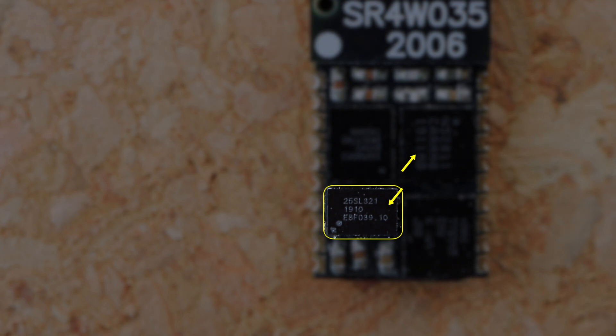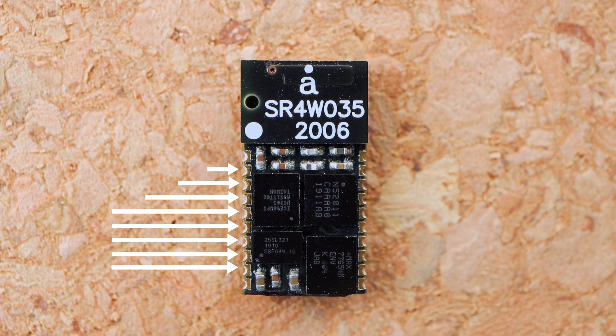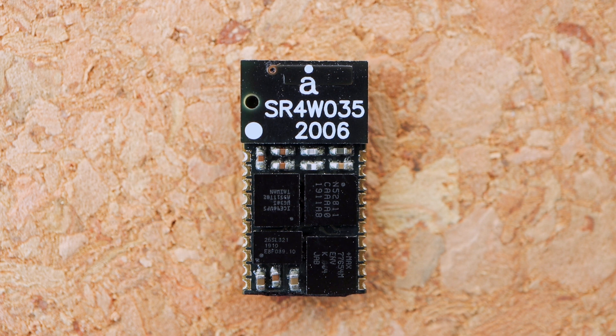The majority of the I/O go into the FPGA. This is where you can do any signal processing or data acquisition before passing that data to the Bluetooth chip. There are, however, two I/O that go directly into the NRF52 chip. These can be used for any of the NRF52 peripherals, such as ADC or waking the module up from deep sleep mode.